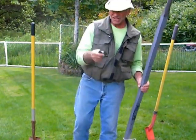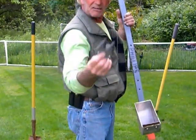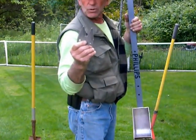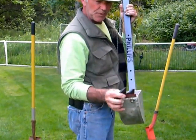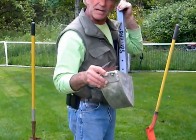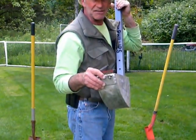Other applications: the cleaner blade and this is the ripper blade. Let's say you need a little more out of the bottom — you've got roots, you've got rocks. The ripper blade is interchangeable. It will rip it up. Then you get the cleaner blade back out and make it as smooth as you want. A lot less hassle.